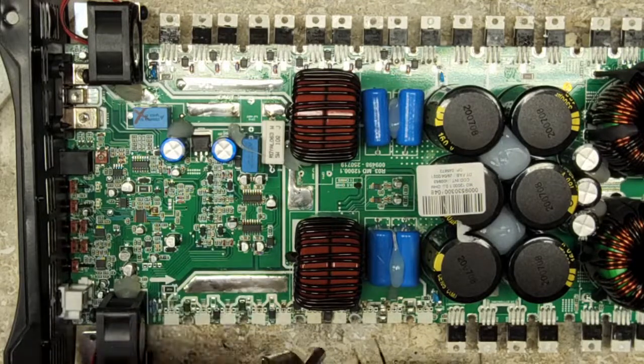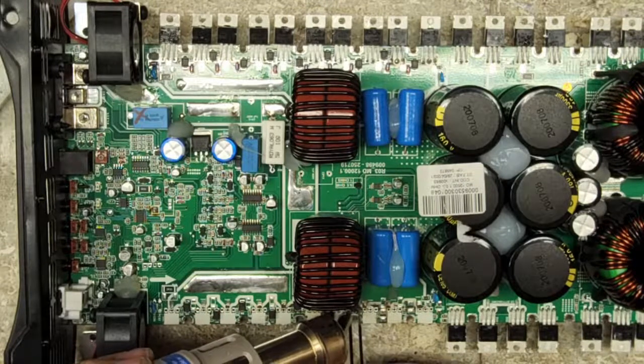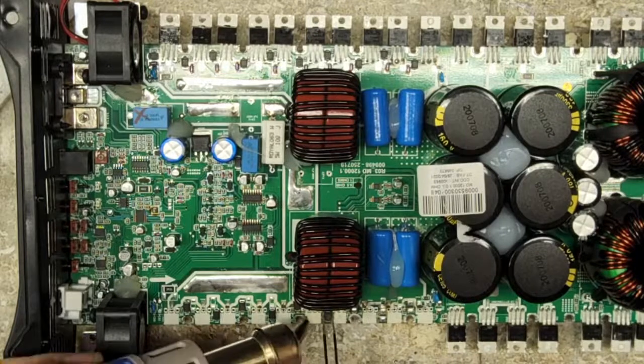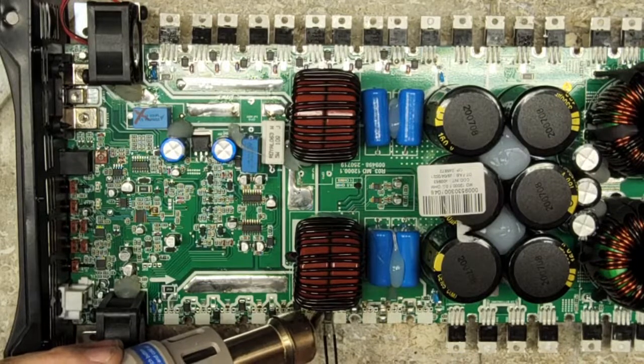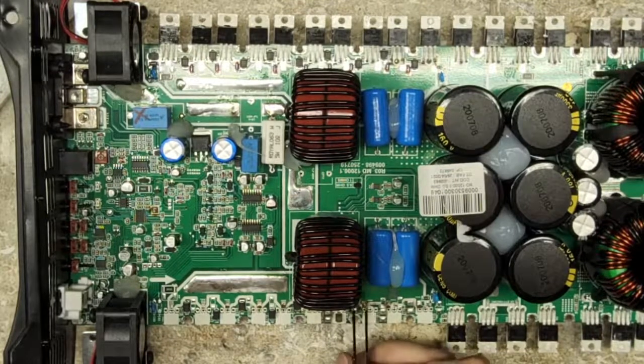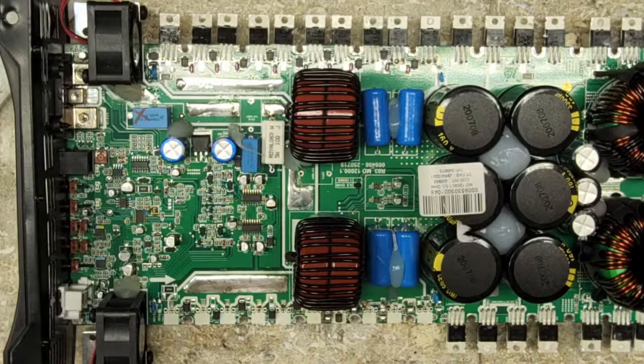Now the bands for the cathode and anode on these are marked pretty decent compared to the Zener diodes. Kinda. For instance, the one I just pulled off here, I cannot see the marking on the board, so I have not spun that diode around. So I just got to double check what direction it's in. 1, 2, 3, 4, 5. So this is 5 and 5. I'm going to do the first 5 diodes there. And I got to check the direction of that one. Whew. Boy, that diode is black. So it looks like all the gate diodes are in the same direction.